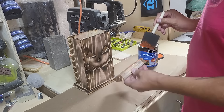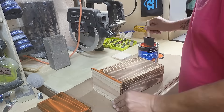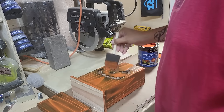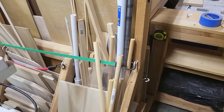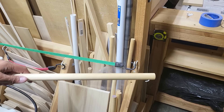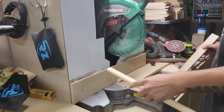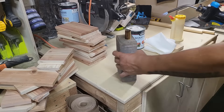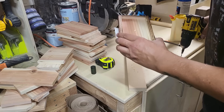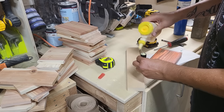Once burned, you're ready to apply the stain. I did this one in orange for the jack-o'-lantern look, but I also did a few in white to resemble ghosts. I plan on doing some in green for a Frankenstein face and possibly black for a cat, but you can use whatever color looks best with your chosen design. The final touch was adding something resembling a pumpkin stem that also serves as the lid handle. I used seven-eighth inch dowels from my scrap bin, cut to one and a half inch pieces, gave them a quick burn, and stained them green. Then I pre-drilled and countersunk a hole in the center of the lid top, pre-drilled the stem, and attached it with glue and a one-inch screw.